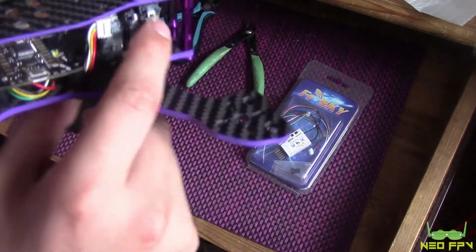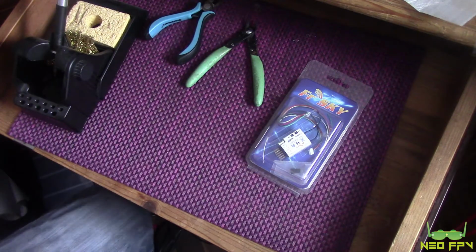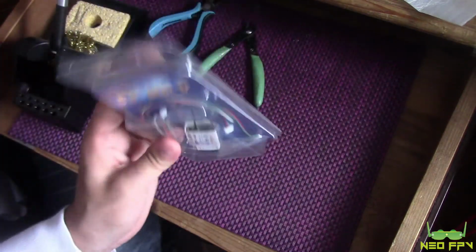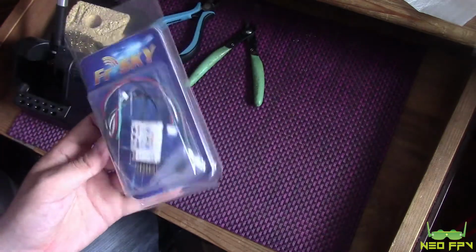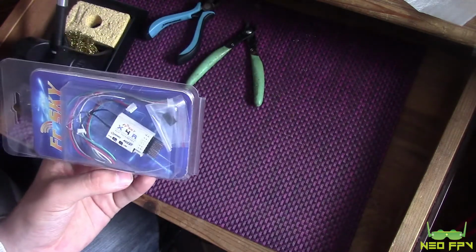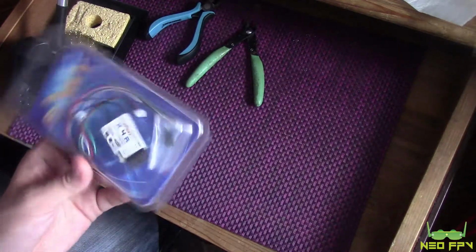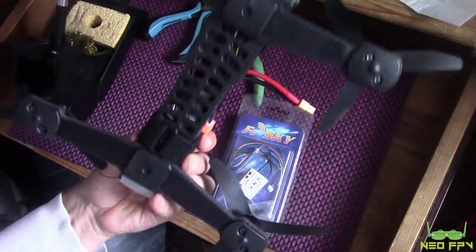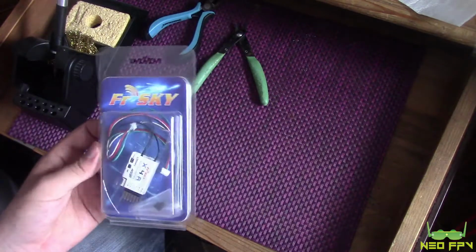there's a little bit of hot glue there, and I've actually soldered on UFL connectors so I can snap on new antennas, which with these X4Rs is already the case, which is one of the reasons why people opt for these over the XSR. However, this is a little bit big to fit where I need it to go inside the bottom of this Vendetta. So this is my first ever attempt at de-pinning this,